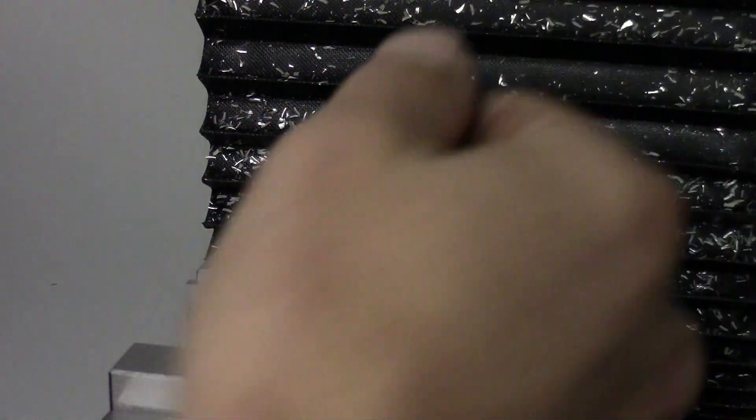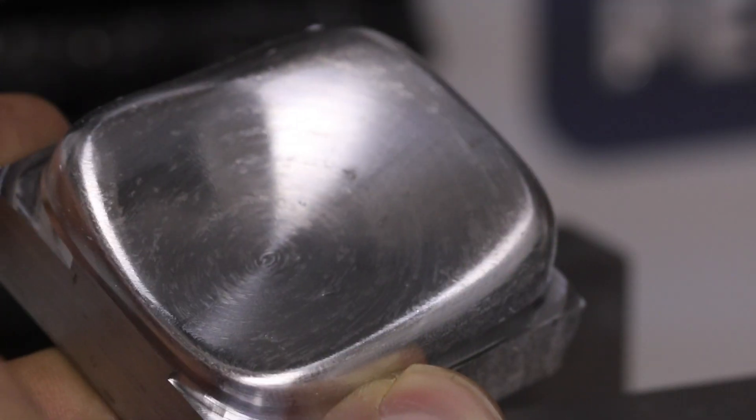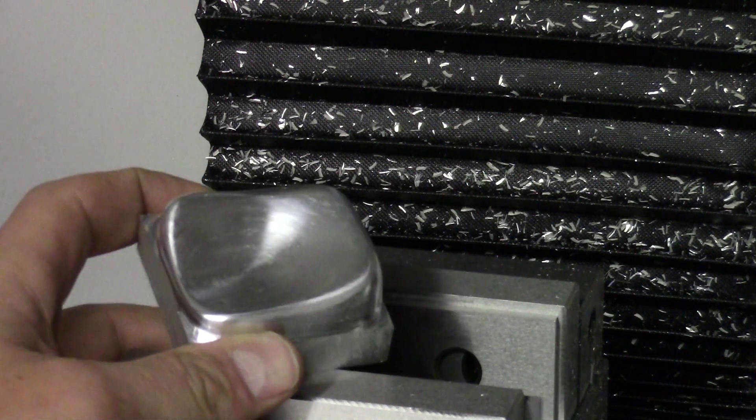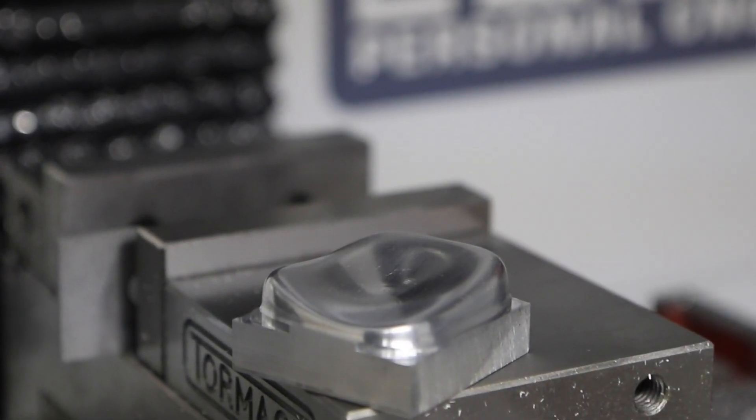Let's take a look at this thing. Not having any sort of coolant, I'm wondering if that's one reason why we get some little lingering chips - it might just be my feeds and speeds. You get these little grainy spots; I don't think that's the machine at all, I think that's chip getting recut. I don't know where I got this carbide ball end mill from, but let me hit it with a Scotch-Brite pad real quick. I think that's pretty darn good. I hit it with a Scotch-Brite wheel and a quick polish. I think this is spectacular. I'd welcome tips in the comments for better 3D machining or CAM strategies.